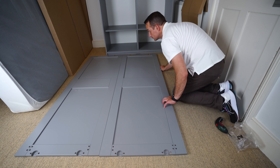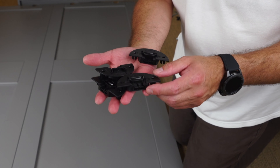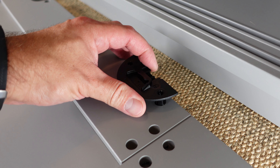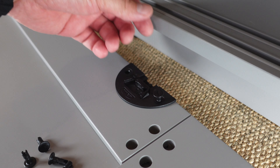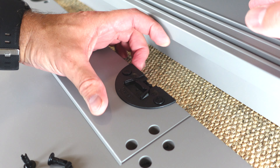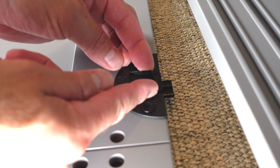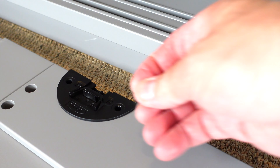Now for the door hinges. The hole for the door handle should be on the outer side — leave them positioned exactly as shown. There are four top hinges and a second part which is the plastic plaque. Place the top hinge in the four holes on the outer side and secure with the plastic plaque — two of them securing each hinge. To unlock and lock the hinge: press and push down to unlock, push up to lock. Leave the hinges unlocked for now so you can place the doors into the rails. Same for all four hinges — two per door.